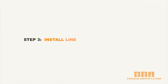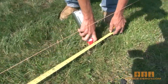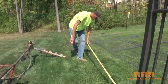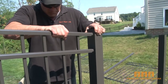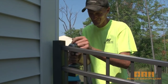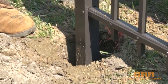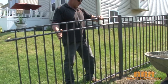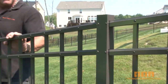The next step, once you have your corner posts installed, is to install line posts and attach sections. Start at an end, corner, or gate post and dig holes in the direction of your fence line. Holes should be dug 71 and a quarter inches apart on center for a two-inch post and six-foot wide sections. This number will change if you are using a larger post or eight-foot wide fence sections. Slide a fence section into the starting end, corner, or gate post, then slide a line post on the opposite side. Concrete the line post in the ground following the same steps, making sure it's level and plumb. Repeat this procedure down your fence run — section, line post, section, line post. Don't forget to secure each section with the self-tapping screw provided by the manufacturer.